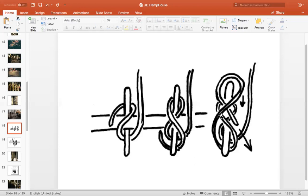And then you can start taking off the wraps that are actually around the pin, going to that point where you're comfortable holding it and you're going to let it in or do whatever it is that you need to do. But you're always in control. If I take a couple of these wraps off and I'm holding on to this and it starts to move on me, all I have to do is step either to my right or to my left, whichever side of the pin you're on, and pull the rope across the wraps, and that creates enough friction to hold the load for you.